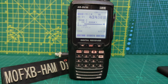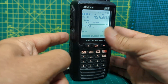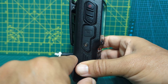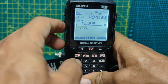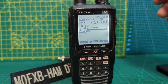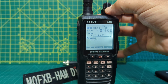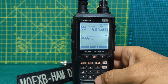For squelch, you can see it says NSQ005 here. Press the button on the side - the one beneath the on/off button - press it briefly and it highlights in dark grey. Then turn what I'll call the channel knob, which is the lower knob, to about four, and press enter. You've done the squelch.